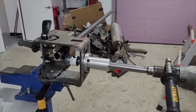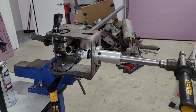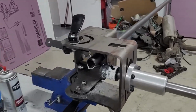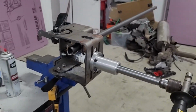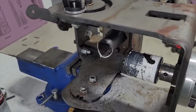So my recommendation would be, if you're just doing a couple parts, yeah, just grind it. But if you're going to build a cage or fabricate your own control arms or something like that, at least buy a cheap one of these. I think they make cheap ones for like $100 nowadays, maybe 200, and it's going to be way better than having nothing. Basically, when they don't have rigidity, you've got to go more careful.